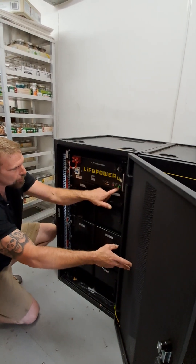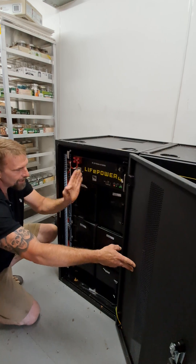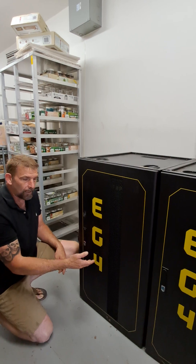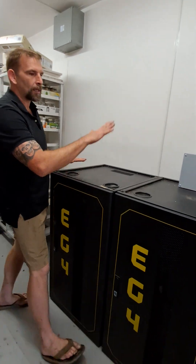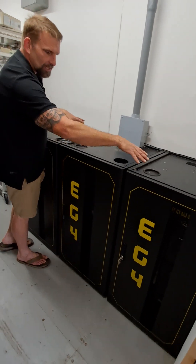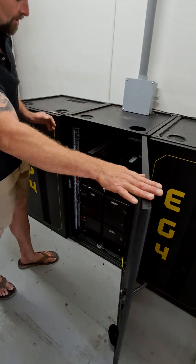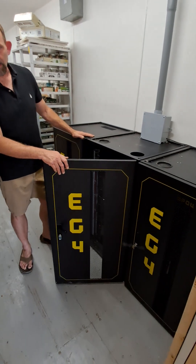He is in charge mode, as you can tell from this blinking light — 75 to 100%. We have a BMS app that allows us to operate efficiently and monitor the batteries individually instead of as a pack. Inverter one and inverter two are sitting on these three batteries here; the center battery is more of a storage battery. So 30 plus 30 plus 30 equals 90, plus a 5 KW and a 5 KW equals the 100 KW the customer was asking for.